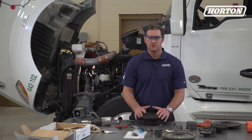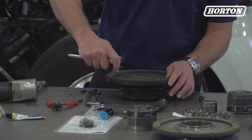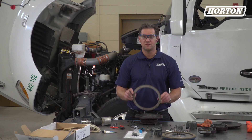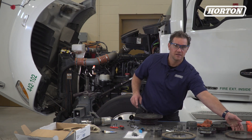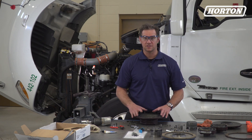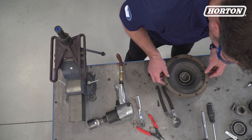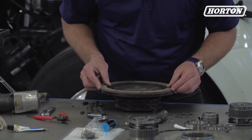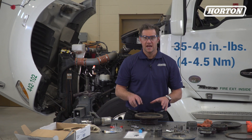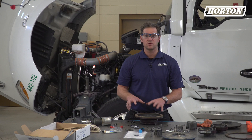Next, onto what's called the friction facing. Remove these head cap screws and the old friction facing. Then install the new friction facing. When you do this, make sure the tapped lockup holes in the pulley are aligned with the lockup holes in the new friction facing, just like this. Alternately and evenly tighten the Torx button head cap screws to between 35 and 40 inch-pounds or four to four and a half newton meters. There should be new screws for you in your kit.